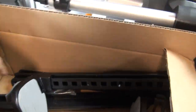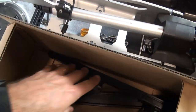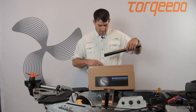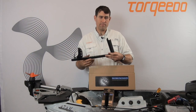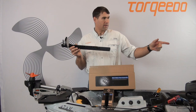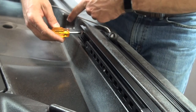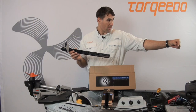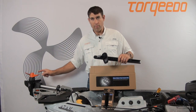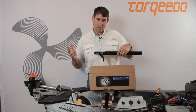The stern motor foot control kit is basically a rudder kit without the rudder parts you won't use. It enables you to swap out the fixed adjustable foot pegs with ones that have an extrusion the foot peg slides into, which hooks into the Dacron line. That line runs through the pre-run tubes, comes out the back of the boat, and connects to the steering triangle on the motor — essentially allowing you to steer the motor with your feet, just like a rudder.